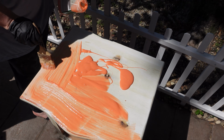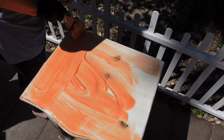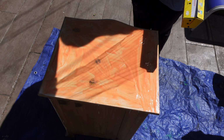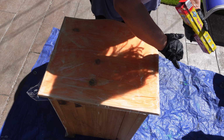Sometimes with citrus strip, you just put it on, leave it for 45 minutes with some plastic wrap over it, and then take off 1 layer, apply it again, leave it for 45 minutes, and take off another layer. Sometimes that's actually the easiest thing to do because you're basically just waiting the 45 minutes in between.